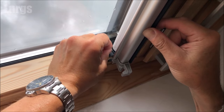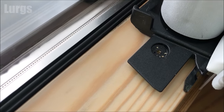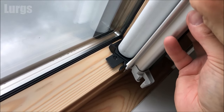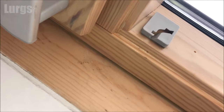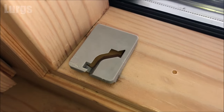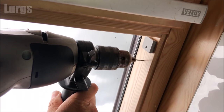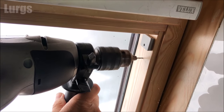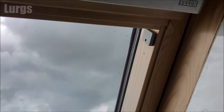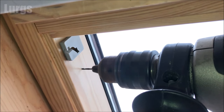What I'm going to do then is use a drill with a really small wooden drill bit — the smallest one you can get, which is smaller than the screw you're going to use — and just drill a pilot hole into each one. It's so much easier to screw in if you've already got a pilot hole, and also screwing into hardwood is very difficult with the danger it might split the wood. So I recommend drilling a small pilot hole. Make sure the drill bit is nice and level — you don't want to go in at an angle.